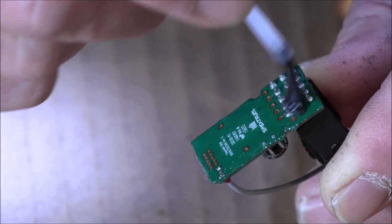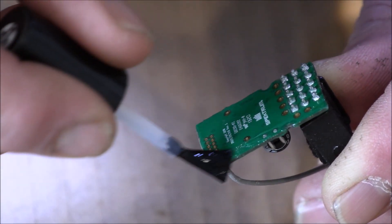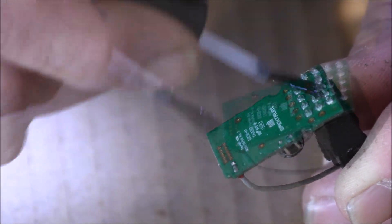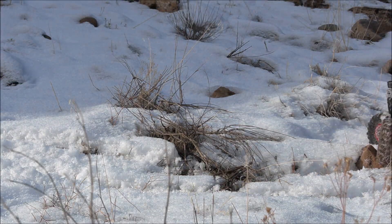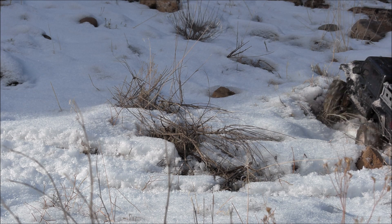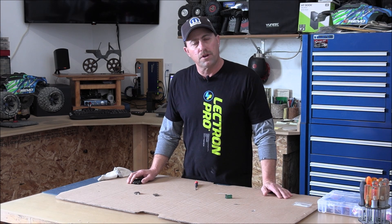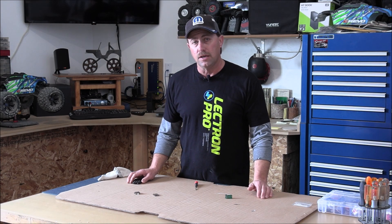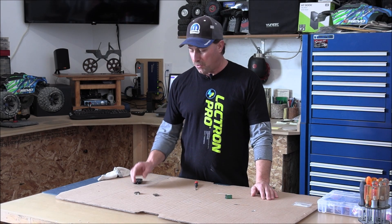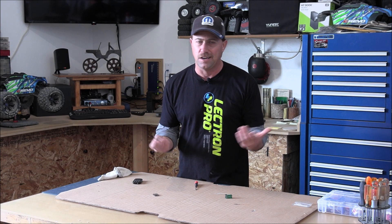We got our front side done — I waited just past an hour to make sure it's dry. Now we're going to flip it over and do the back side. I'm going to use the brush that's in the bottle now since there's nothing to be really concerned about on the back side — just make sure it doesn't run to the front side and get into the button. I'm going to coat this pretty liberally, going in one direction and then the other to make sure it's coated well from all different angles. The instructions say you only need one coat to really protect your electronics. I'm going to let mine set for about two hours so the coating doesn't stick to the inside of the case when I reassemble it.